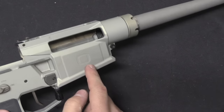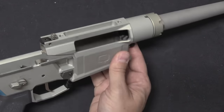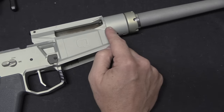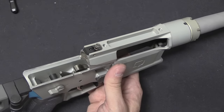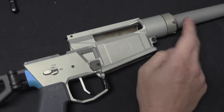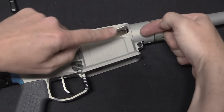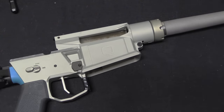Note that this is an aluminium receiver, but it has a lockup — the locking recesses are actually machined into the steel barrel itself, similar to an AR-15. The bolt head locks directly into the barrel and the receiver is not under pressure at all when firing, which is why you can make a small lightweight aluminium receiver without safety issues. Compare this to a traditional bolt action like a Mauser, where the locking recesses are in the receiver, the barrel threads in, and the receiver is under stress when you fire as the bolt and barrel try to push apart from each other.